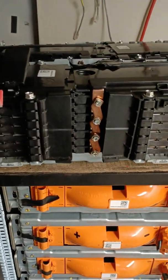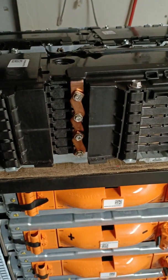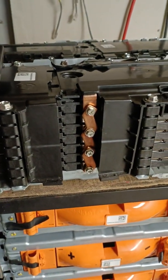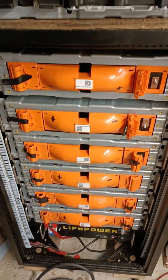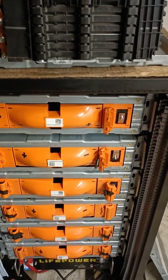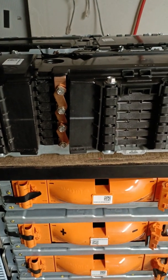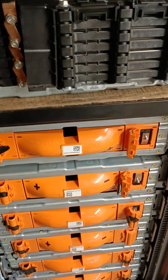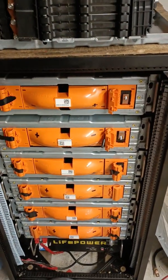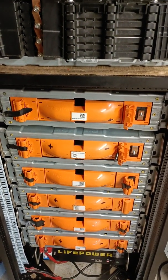I took these batteries — originally these cells were in series — and I took the little copper bars off the side and paralleled the cells. So each of these batteries in the stack have 14 of these flat cells, and that's two sets of seven cells in parallel. We're going to series all that together into one giant series battery across all seven of these packs.